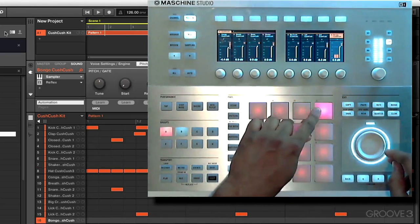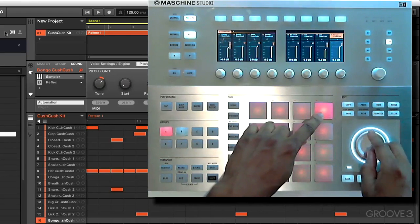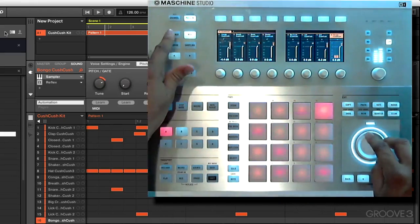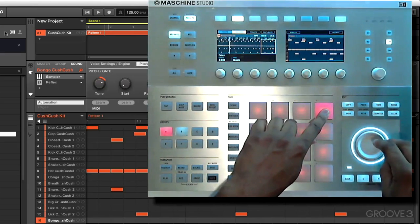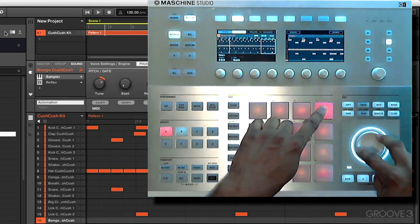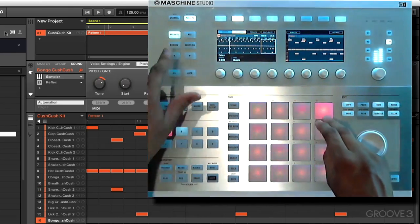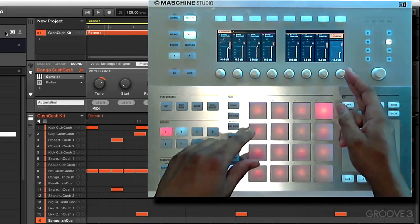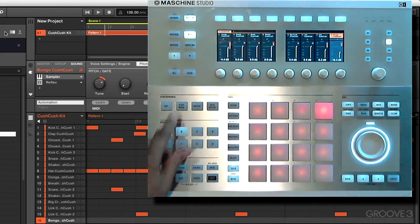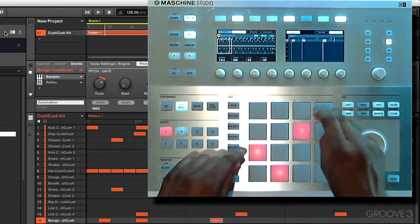I kind of like this sound and I want to change the pitch. If you hold the sound down, click the jog wheel, you're actually in a pitch mode where you can adjust the pitch of the sound. As you can see, I'm turning the jog wheel and the pitch of the sound is changing. We're going to go up — okay that sounds good. Adjust the volume a little bit, bring it back down.